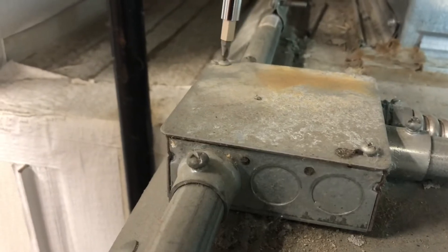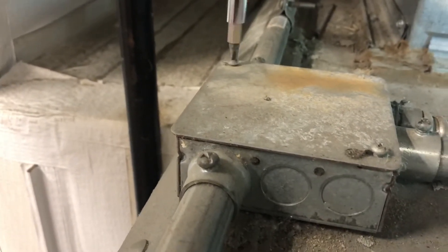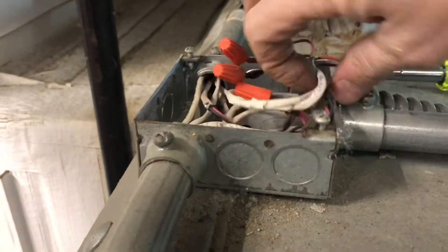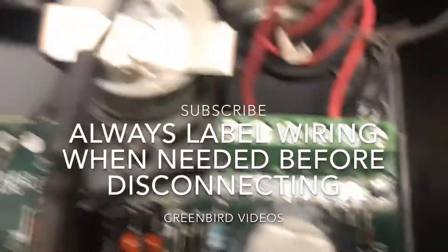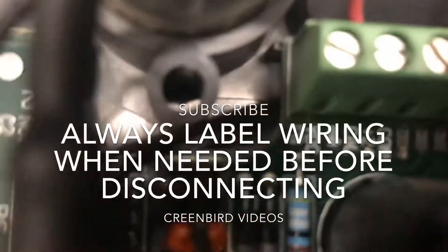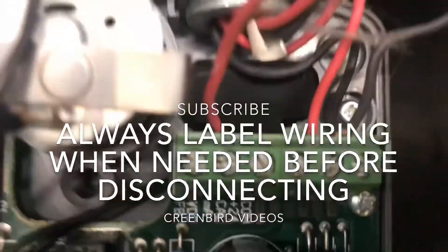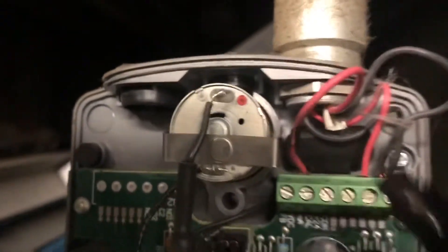Here's our box that has our connections for our actuator — electrical connections. My wiring for my old actuator. I'm going to mark my VDC wire, which is the control wire, with a marker so I know which one it is. I've seen I have multiple wires the same color on this wiring. I'm putting a little black mark on this red wire before I pull it through.